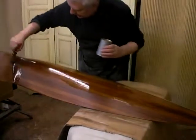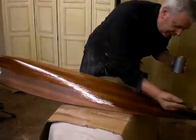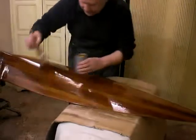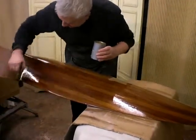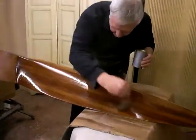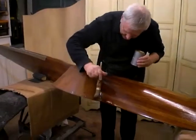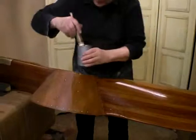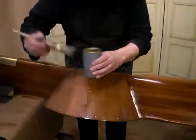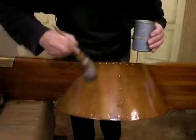Just keep that edge going and as I say, don't go back — we can eliminate any little bits that are missed with the next stage. What we're going to do next, when this is dry, is flatten it down again. Then we're going to use a French polish rubber, which is actually a cloth — I'll show you, I've already made a rubber — and that will leave out any discrepancies before we finally finish it.